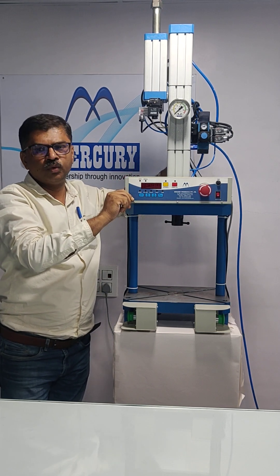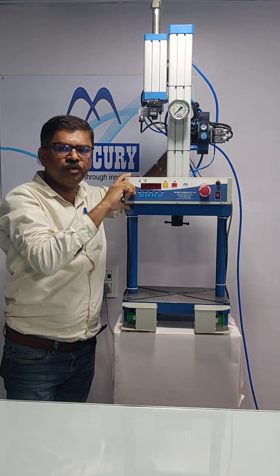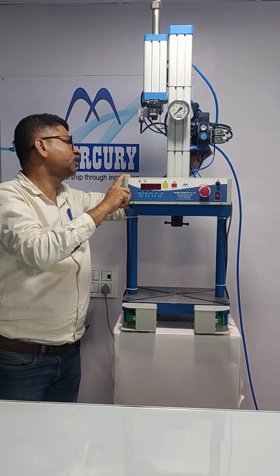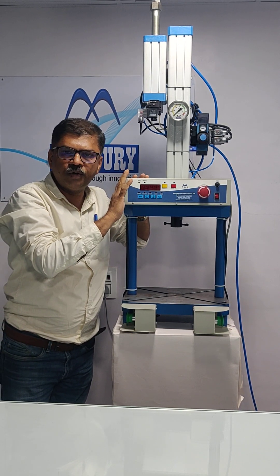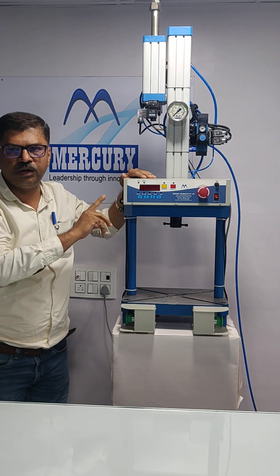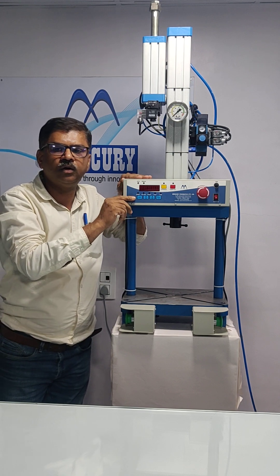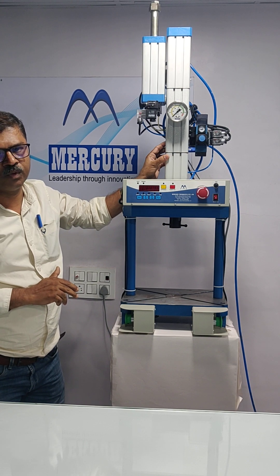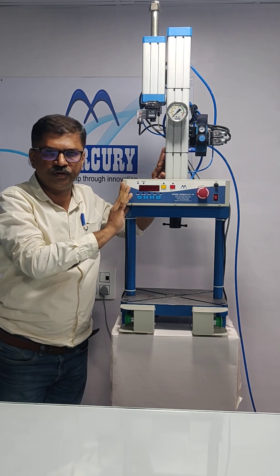On a yearly basis, the silencers need to be cleaned properly and the condition of hose pipes should be checked — if any breakage or loose joint is found, it needs to be corrected. The machine is designed to give 1 million cycles of trouble-free operation. After 1 million cycles or 3 years of use, the seals of the cylinders need to be replaced. Kindly ensure all these points for the better performance of the cylinder. Thank you.